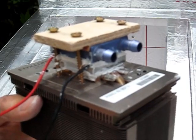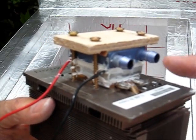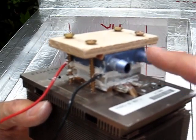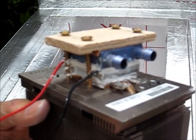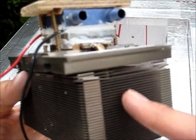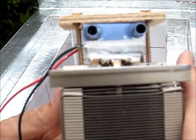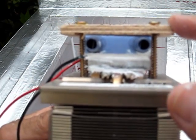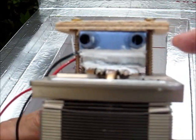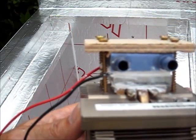Here's a close look at how I've mounted the Peltier device, which you can see in the middle with the two cables. You can also see the cooling block there with the inlet and outlet pipes, and down the bottom the hot heatsink. I've achieved a bit of thermal insulation by mounting it and squeezing it in with wood, because those screws will heat up — but there's just a little air gap down the side, so we have got a thermal break there.